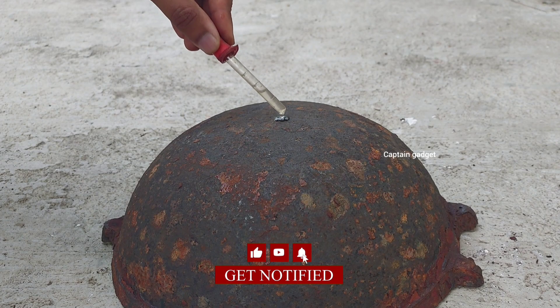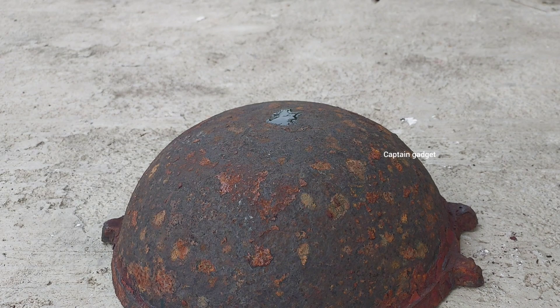When you drill thick metal, if you see smoke, add more lubricant. Apply downward force and drill slow.